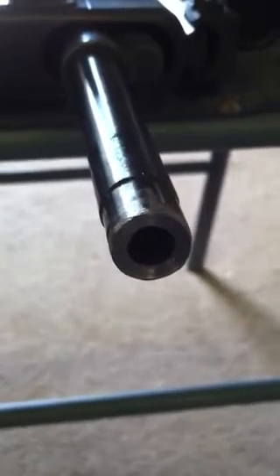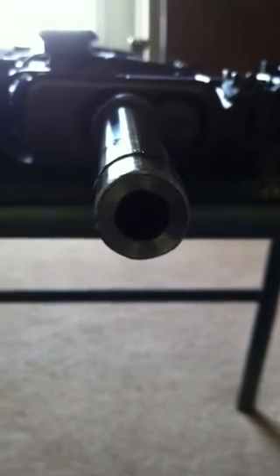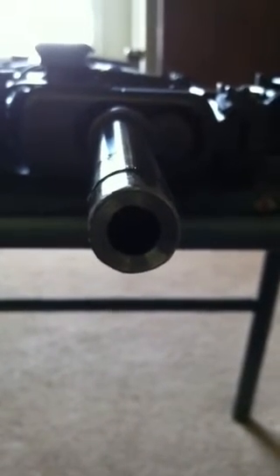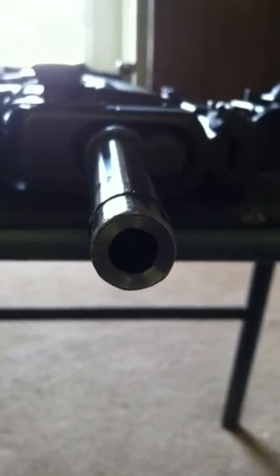See if I can get this to focus for you. There you are — 11 degree. I think what I should do here is take some sandpaper or some emery cloth, sand her down and get her smooth, then get a brass lapper and some compound and clean that inner edge out. And then as soon as my die comes in I will thread it and I'll make a video of it. There she is.